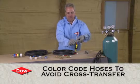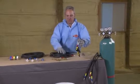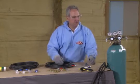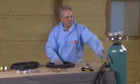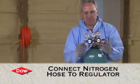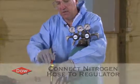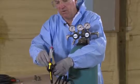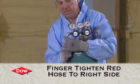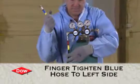The red A side or iso side, and then the blue polyol side — we never want to transfer across these two hoses, so we color code everything so they don't accidentally get crossed. If they did get crossed, you'd make foam inside the hoses and they would be no longer usable. First thing we're going to do is hook up our nitrogen hoses to the regulator. Since the gun has the red or A side on the right side, we're going to put the red hose on the operator's right side and the blue hose to the operator's left side.